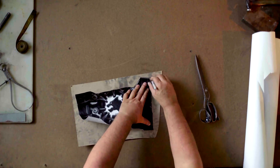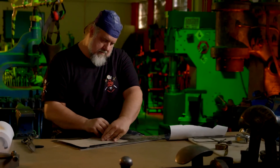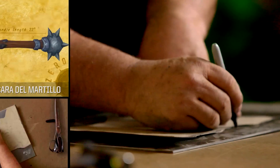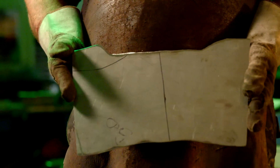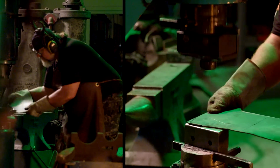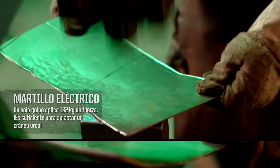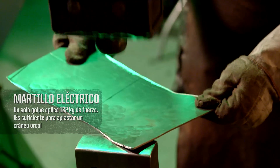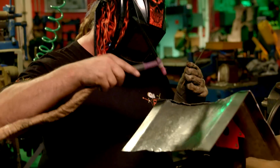I take a look at the drawing and create a paper pattern. Next I'm going to work on tracing the sides of the hammer face onto 11-gauge steel and cutting that out on the bandsaw. After the panels are cut out, I'll bring them over to the power hammer and hammer in a lava-type distressed look on the hammer face. Then I'm going to weld the seams together on these two edges to make a rectangular hammerhead.